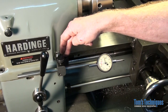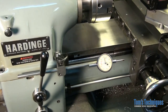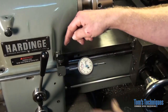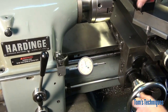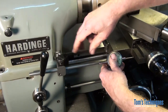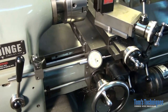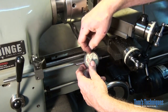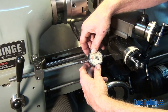This bracket was made specifically for the Hardinge, but you could make a bracket to fit your lathe just as easily. Anybody with a machine shop can make a piece of bar stock with a flat on it — no big deal. All you have to do is position the indicator height-wise so it pushes somewhere on your carriage, so you can read where the carriage is.